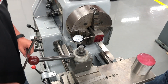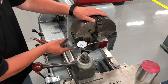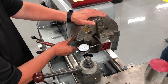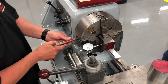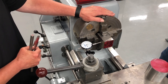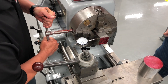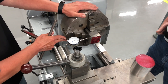I'm going to reset my zero. Looks like we're at about negative two. We should be able to get this to within about two or one, because the block is pretty rough — it's taking more hits than Elvis. Looks like we're within about one. I don't know if we'll get it any closer. I'm just going to snug this one up just a little bit. This is kind of a really finesse-y little process. Negative one.